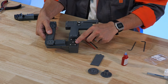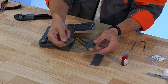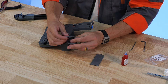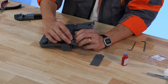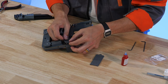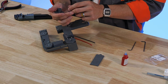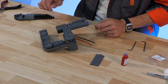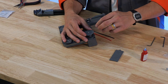Now that we've installed the M3x8 fasteners, we can move on to the installation of the waist spool. You can see the square recess on this half and the square peg here — those go together. Then we take the D-shaped recess and match it to the D-shape on the shaft. You could do this in two parts: press that on and then match that up on top. We'll then take the M3x16 countersunk and install that in there.